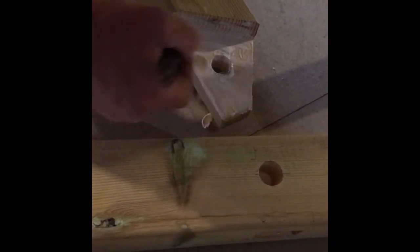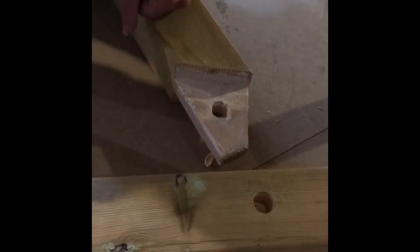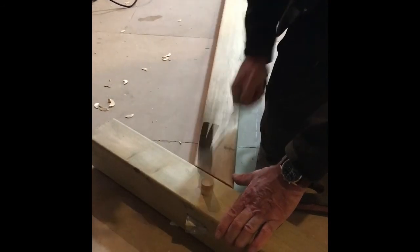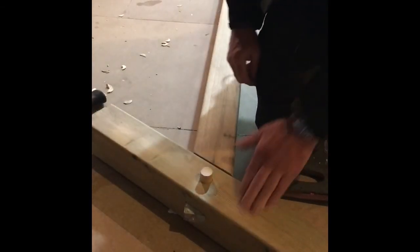There's the finished hole drilled into the tenon, slightly offset from the one drilled in the frame. We're applying PVA glue because they're a nice snug fit — these tenons don't need any gap filling, and the PVA gives us a bit more time to square up the frame later. There are quite a few joints in this frame — I think there's 14 tenons. That hole is approximately 2mm further towards the shoulder than it's showing on the mortise, so once that goes together and we drive the dowel in, it'll pull up to a nice snug fit. The dowels are only visible from the inside because it's end grain — we don't want that weathering on the outside. They're hardwood and they're pulling the shoulders up nice and snug. There's no way we could get a sash cramp on this frame — it's above five metres high.